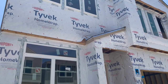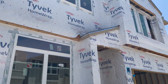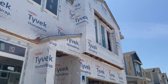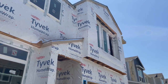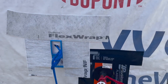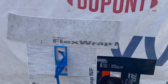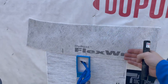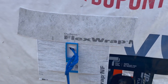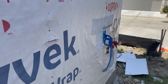Here we'll just recommend tape improvements. They did add kickout flashing, which is great, so we're going to recommend better taping at this location. Same thing here — just recommend a little bit of tape around where the home wrap is torn. If you're wondering what kind of tape, there are two different types that would work. This tape is actually done correctly — installed so it can shed water, with the side first, then the top. Finding little holes and recommending tape is a pretty common find.